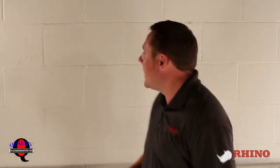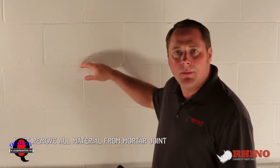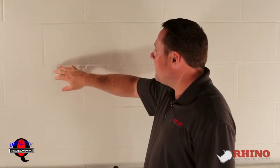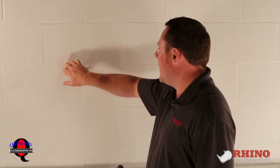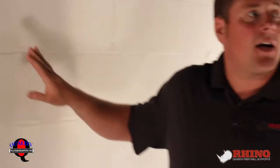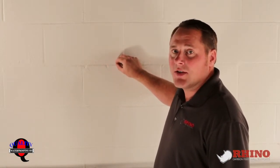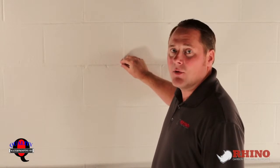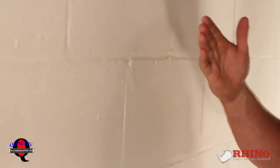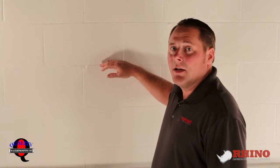First of all, when you're installing carbon fiber, you want to make sure that you do not have any type of caulking in the mortar joints. A lot of times it's painted in — it's really easy to hide. This particular one we know has caulking in here, and what it does is, we put the carbon fiber on here and the wall never comes any further this way, but it could suck back depending on the moisture content on the exterior of the wall. So it gives it a pivot point. You get a call from the homeowner saying they've got a bubble in the carbon fiber and they think something's wrong with it. There's nothing wrong with it — when it reloads outside it'll just come right back to where it was, but it'll never move any further than that. But if we get all the caulking out of there and put something like mortar or epoxy in there, you'll never have that problem.